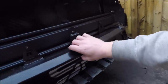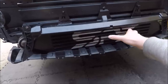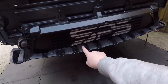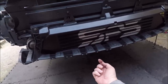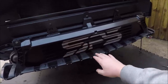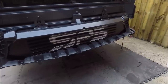So the plan is, if I put two jets — let's say one here, one here — that width of spray, I'm going to drill them through there, should give a nice wide spread. And because they're coming from top down, if we're not going too fast, gravity will bring it down. I did think of putting them in the bottom, but I thought when moving fast, they're not going to spray up very far — the wind will just push it away and it might not soak the top. But if I go from top down, when we slow down, gravity will do some work as well and bring it down. That's my thinking on that.